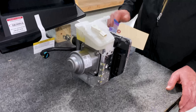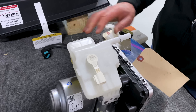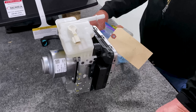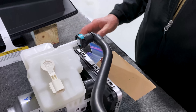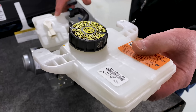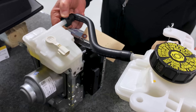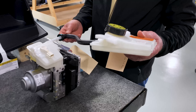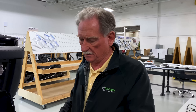This is the braking system in an electric vehicle, doing everything we just described. The difference here is this little bottle with a cool snap fit — you snap it on and it becomes the brake fill bottle going into the module used for modulating the brakes. I love this snap fit; in the past, a snap fit would never have passed muster with all the rules and regulations about how we had to put things together.